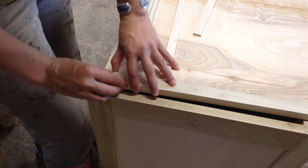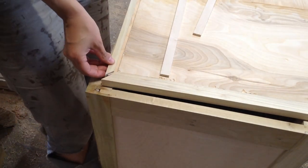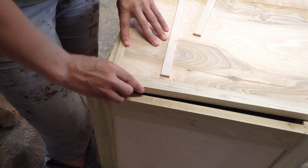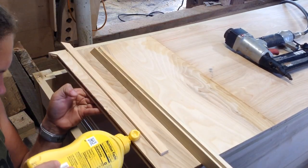But I used 1/4 inch plywood for this shim stock and this, and you could see how those pieces are going to fit. So the edges I left long, you can't see. I just cut the miter, the 45 on the front, and left them long, and I'll trim them down afterwards. And then I could add glue.